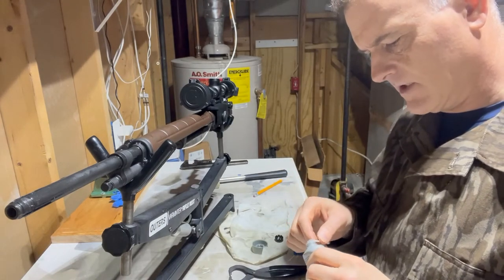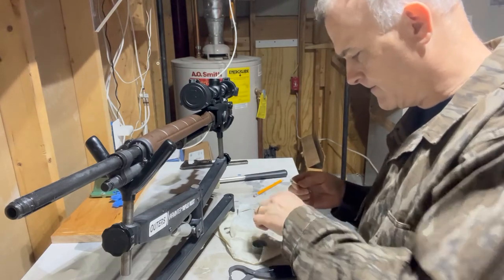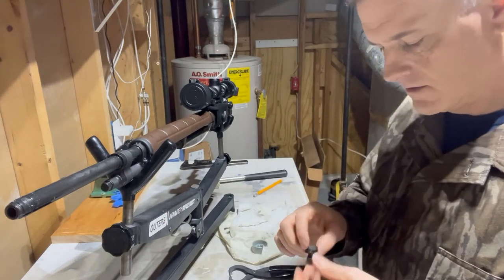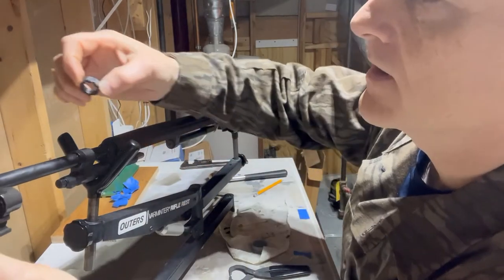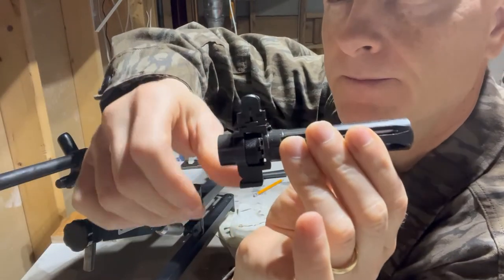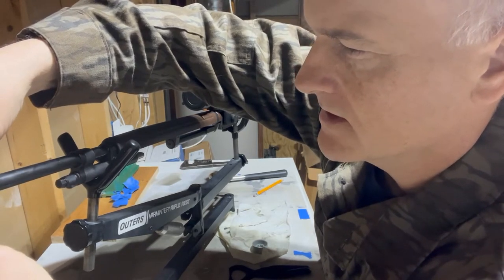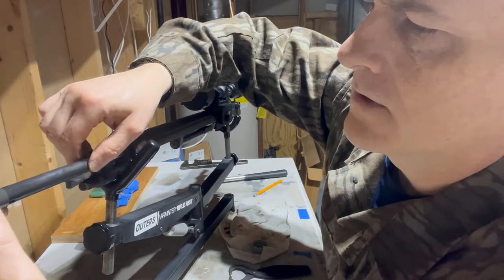So just a little bit of grease again, just some anti-seize. Actually, that goes in the castle nut, because the castle nut's going to be the one that's engaging these threads, and it'll pull the flash suppressor towards the barrel. So what you have to do is support my elbow here. Castle nut, the notches face forward, and you kind of slide that inside the flash suppressor. Good catch. Just kind of hold that on. There's splines that let go into the machined slots, and you slide that forward.